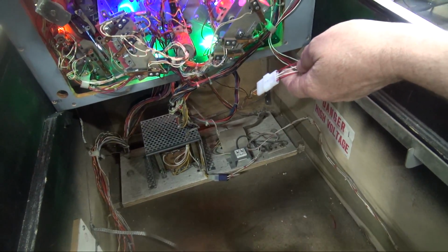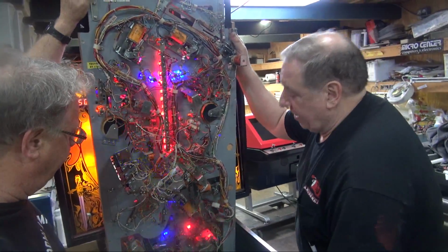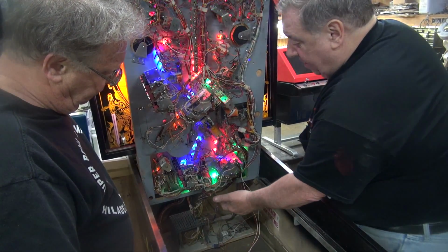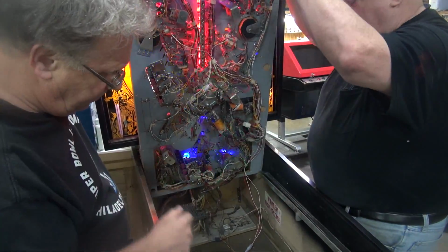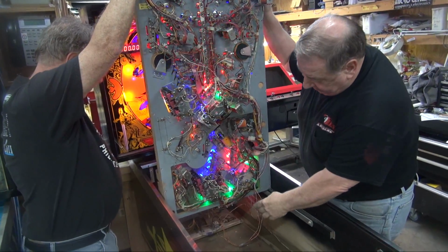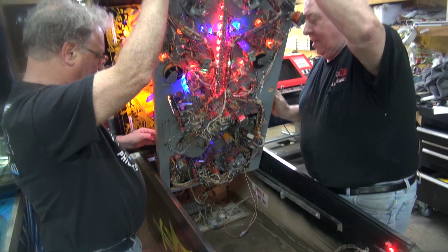Because you have to pull the playfield forward, it's best to not run the wires up. Some people just stretch them up. I've seen all kinds of hack jobs. Then it breaks off. It's no good. Well, it's not even that. You can't service it. This way, whoever works in the game can, in fact, unplug it, or leave it connected and do the normal service. See, like if you lift this up, you'll break it. If you had to lift the playfield up and lay it back, you don't have a lot of room there. There's still enough connection, see? You're stretching the wires. Well, that's actually the playfield wire, not the ones we installed. So put extra cable in, okay?